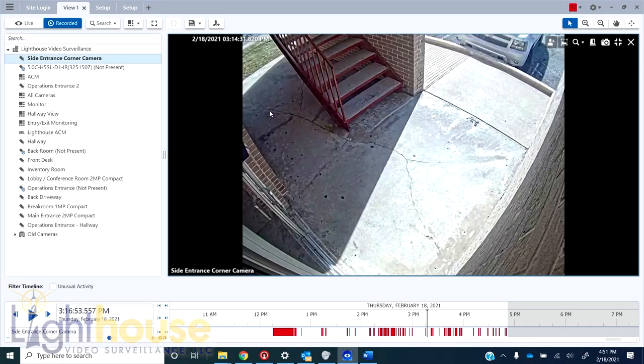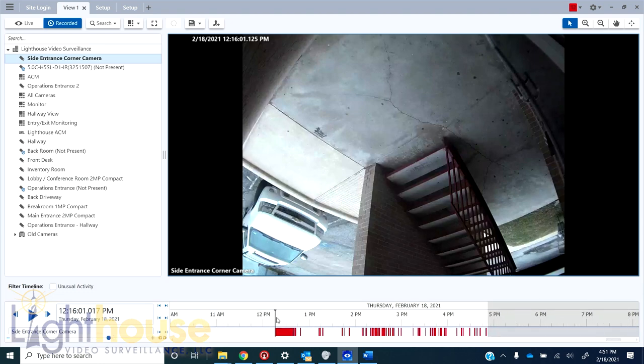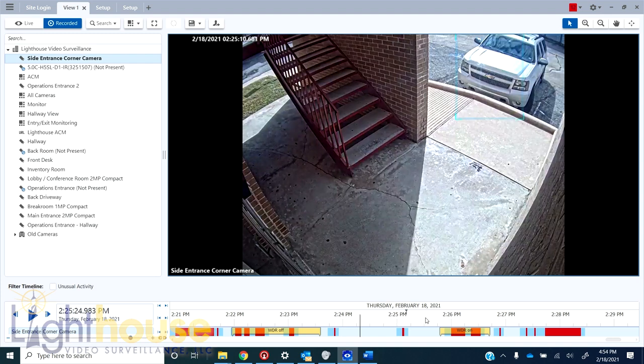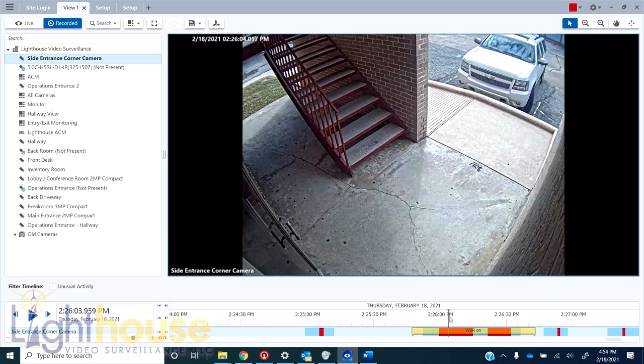You can see the camera was installed at 12:15 — that's when the recording started. You can have the wide dynamic range set on or off. If this was in a jail cell, you'd just leave it off. But being that this is outside in a covered area, it's an ideal situation to have wide dynamic range on, because there's quite a shadow being cast. This video right now is with the wide dynamic range on — notice how the shadow is not that prevalent.